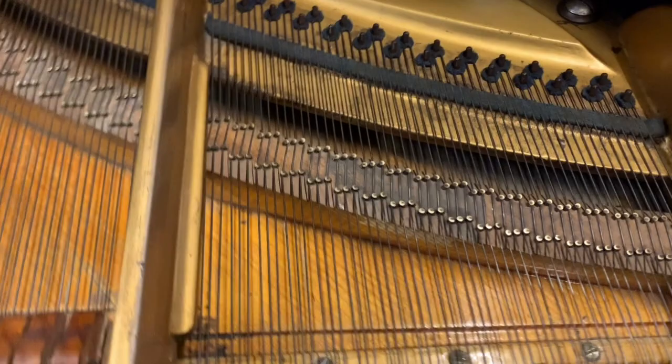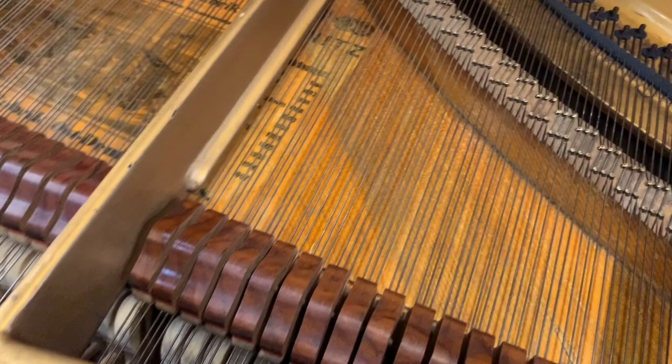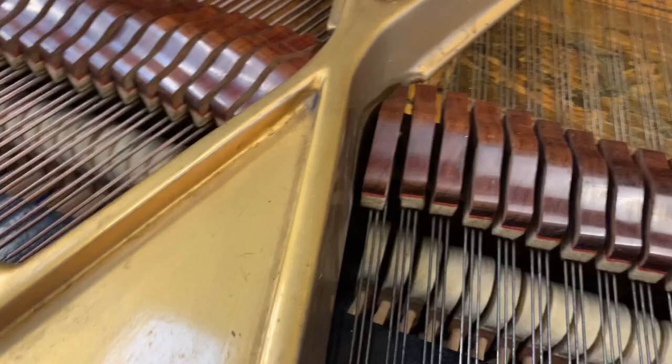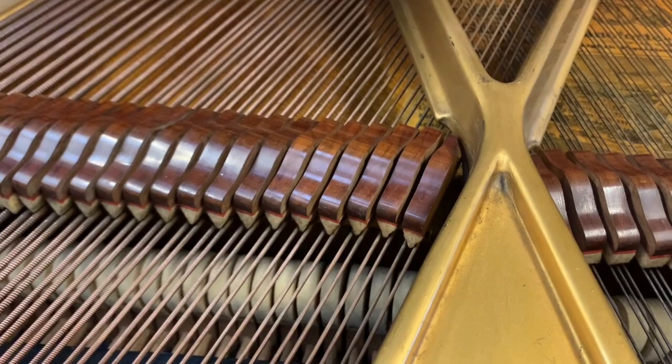That confirms that. So 1908, I think we decided it was. It's still slightly dirty, obviously, unless we restring the piano. We're not going to be able to get rid of all the dirt there. But if you look at the previous video, you'll see that the team's managed to achieve an awful lot there. And just want to lift the pedals up. I noticed that we're going to have to just do some fine work. The pedal's not quite lifting the dampers as high as we'd like it to. Mainly here, they need to clear a bit better. So that's an easy job to do. So just some fine work still to do.